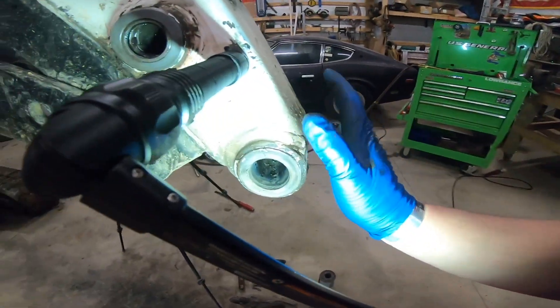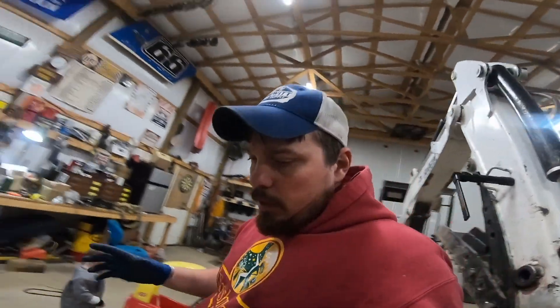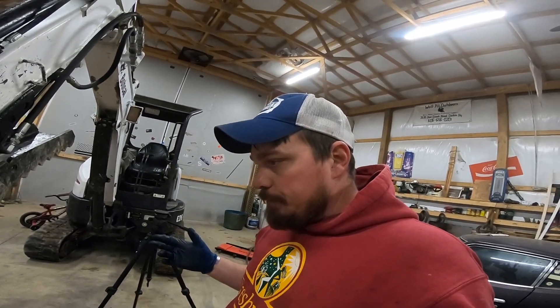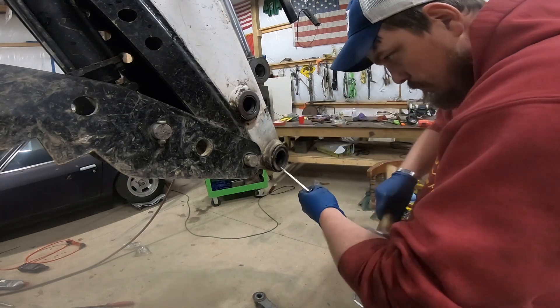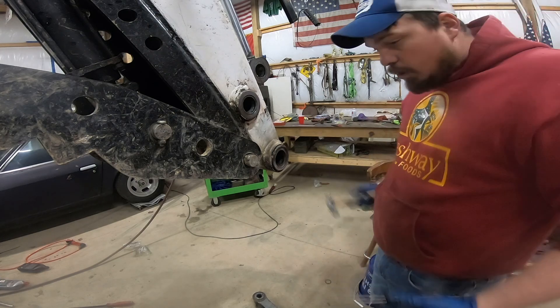While this is still good and hot from the torch, I'm going to go ahead — I have the other bushings in the freezer. When they freeze on a molecular level they will contract, and this is hot so it's expanded, which gives me the best chance of putting it all back together. I'm going to clean that out with some rags real good, clean this edge up, and then slap the new ones in. I was just uneducated — that was just the outer ring, so easy day.